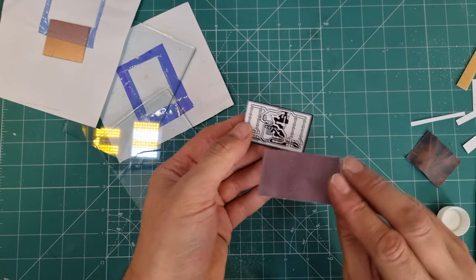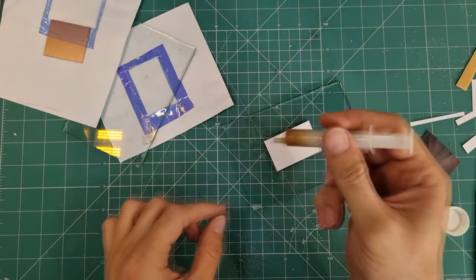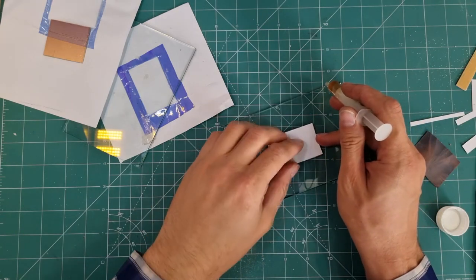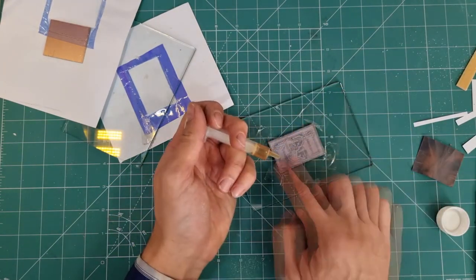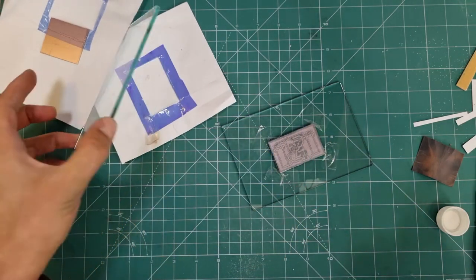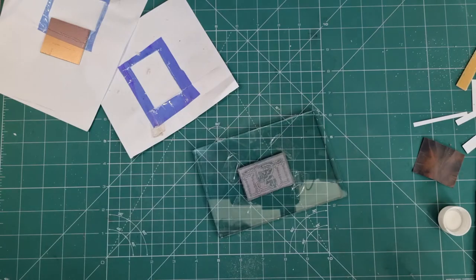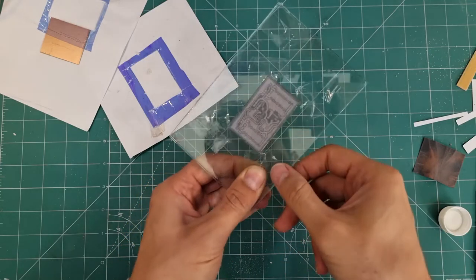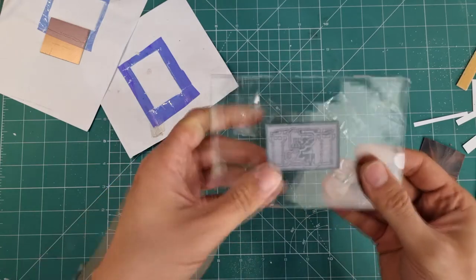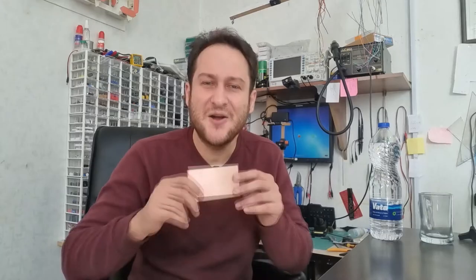Next step is to put PCB film on photoresist dry film. By using some baby oil or sewing machine oil, we can make more transparency on our PCB film. Using these pieces of glass, we can tighten whole sandwich and avoid gap between films. This is perfect. Now we can jump into next step, toasting the sandwich. Our sandwich is ready to toast and now we are ready to know fourth secret.